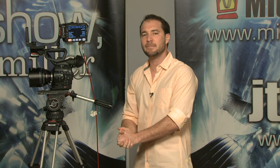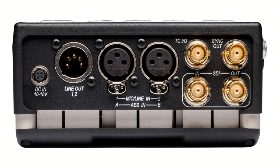Specifically, they've been known in the past for audio recorders. With two XLR inputs, as well as accepting digitally embedded audio on SDI and HDMI, you know that it's going to be up to Sound Devices quality — very low noise, negative 128 decibels on the audio and digital inputs coming in.